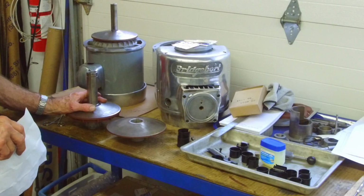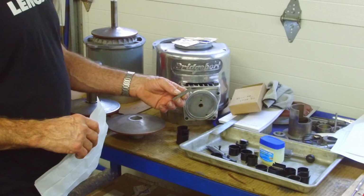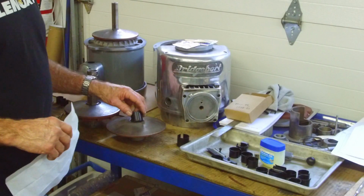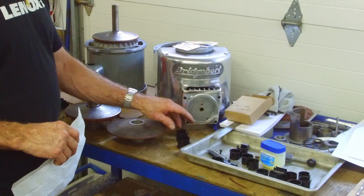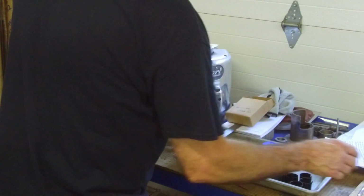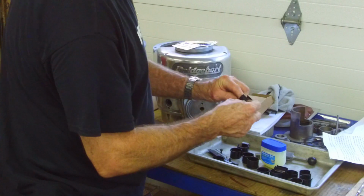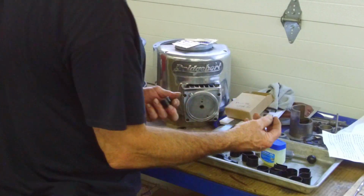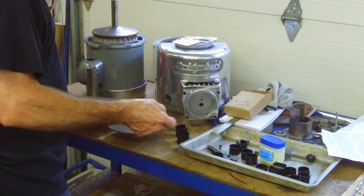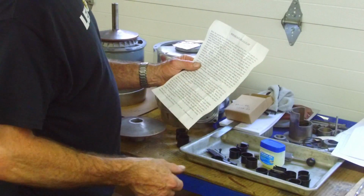Okay, our variable speed control is with these pieces. Now we need these to guide smoothly. Now I picked up a partial kit. At least the kit has the glue, and it had one set of bushings to fit the bigger of the two. The small pulley here, I had to take a bunch of these other sleeves, cut off a portion with the razor blade, and then sand them and fit them until they fit this bore.